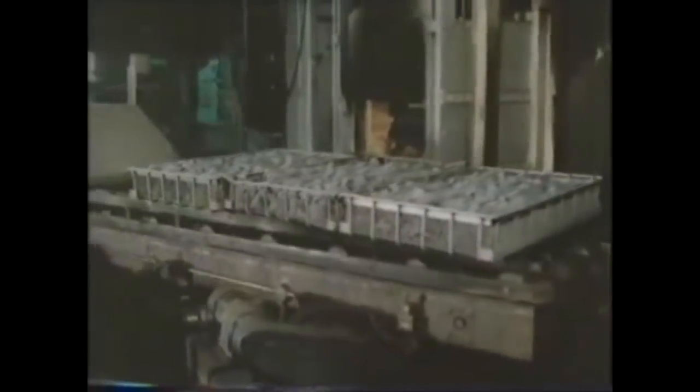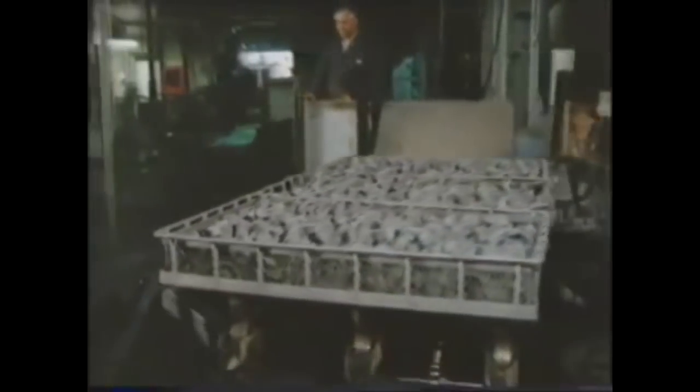The conrod caps are agitated in the oil during quenching, and this helps to cool them uniformly. After the surplus oil is drained away, the components are ready for tempering. This is done at a lower temperature, 580 degrees centigrade, and it's well below the lower critical point for a 0.4% carbon steel. After an hour in the furnace, they're left to cool in air. This complete heat treatment process improves the hardness from 229 to 255 on the Brinell hardness test scale.